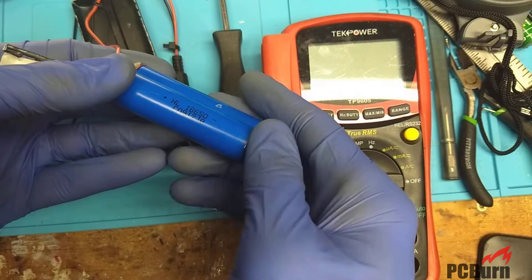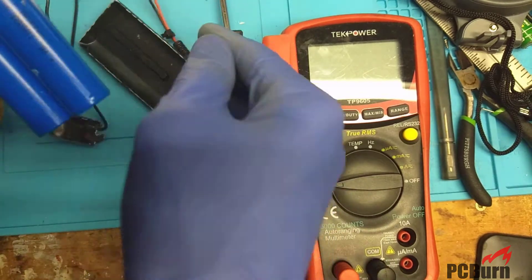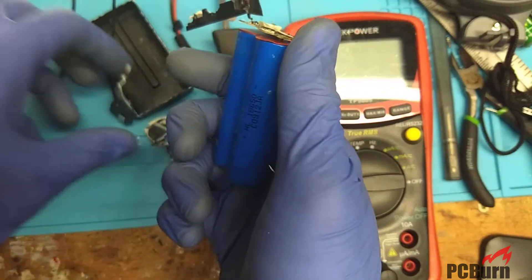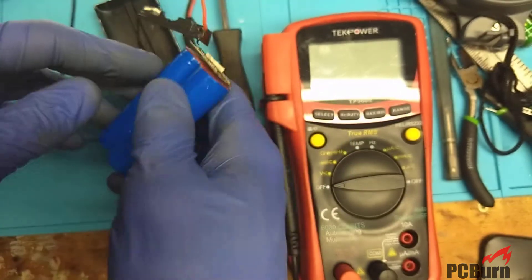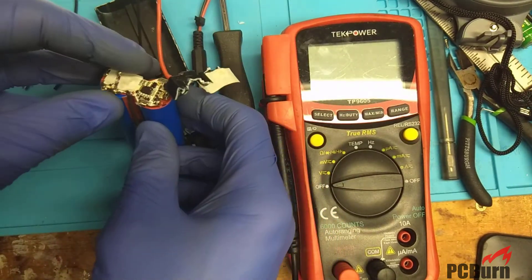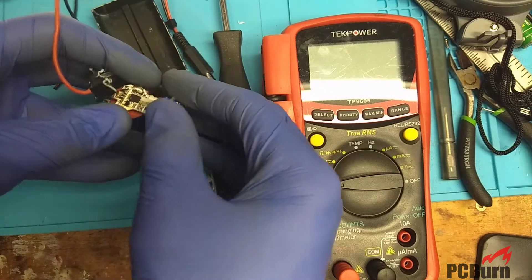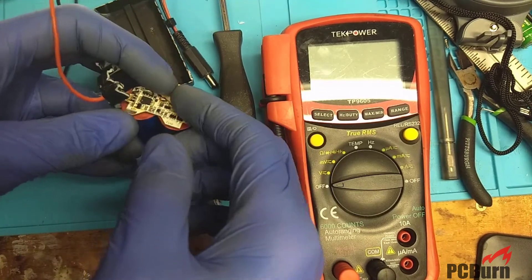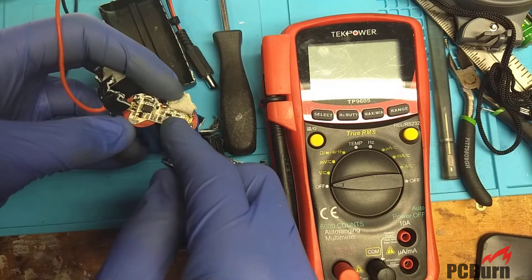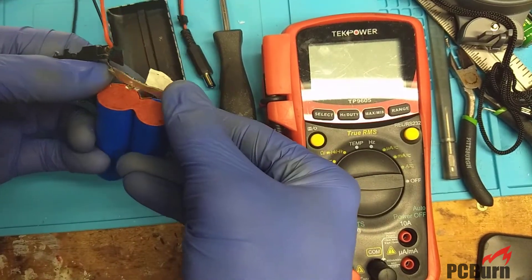And there's our battery cleaned off. It was actually two 18650 cells sitting in a tray, with a temperature sensor bar sticking out on the top. There is actually a balancing connector in here, and it's going up to the HM8202 controller board for charging and safety. That's got a lot of supporting electronics on it, so it's probably pretty well built. I don't see anything else funky on there — it's a nice little control circuit that looks well made.